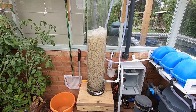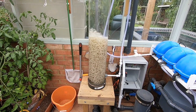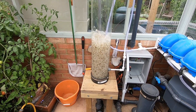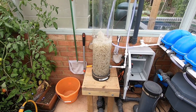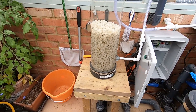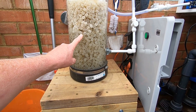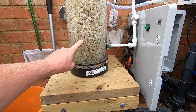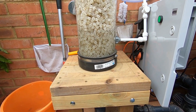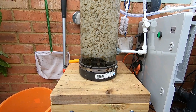Sorry to bore you with this bit, but we'll just see if it works and I've got it on camera. This is going to be spot on or really close. I've opened the manual waste valve fully open, and this is all dependent now on the one-inch valve. We're down at this point — still 11 seconds to go. Seven, six, five, four, three, two, one. The pumps kick back in, so 72 seconds is just not enough — it needs to be about 76 to 78 seconds.